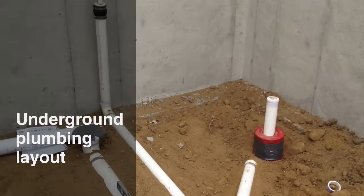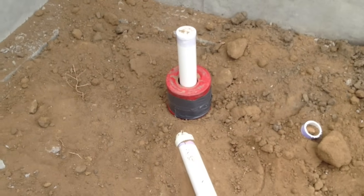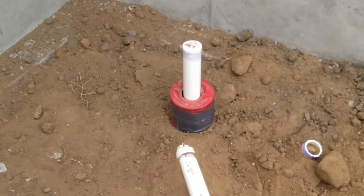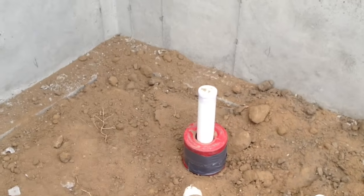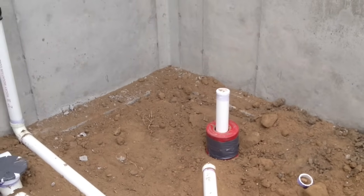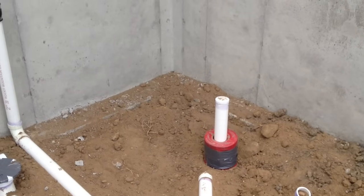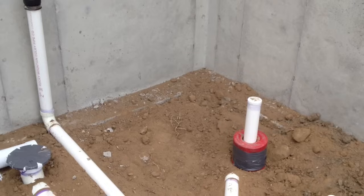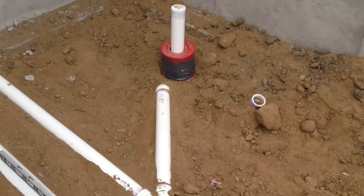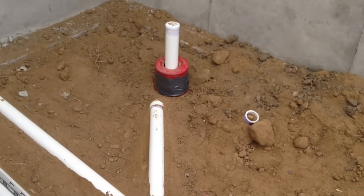The plumbers have roughed in a bathroom. Over here, this is a shower drain — that's going to be for a three foot by five foot shower. They've already done a measurement off the wall to allow three and a half inches for framing, a half inch for drywall, and a half inch gap behind that — so four and a half inches off the wall. From there, you measure out to the center of your drain off of both walls. It's got a P-trap underneath it; the P-trap is buried. That little red can is just to keep the guys from pouring cement around it or burying it up.